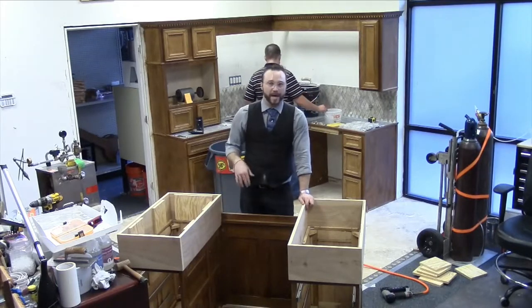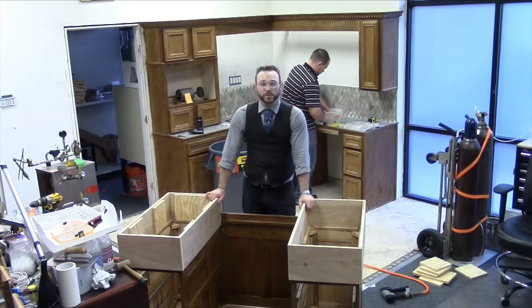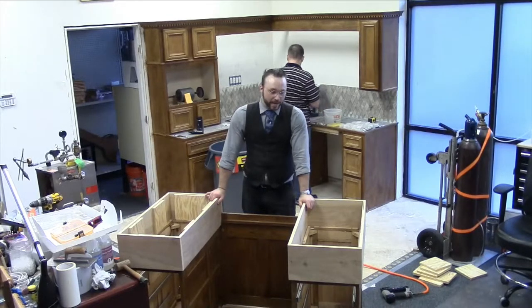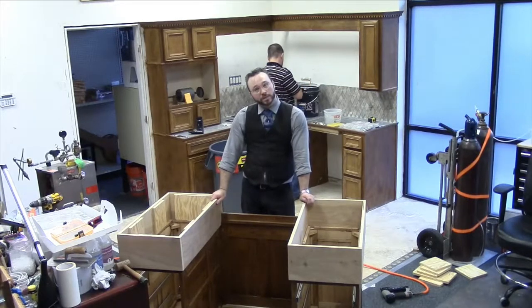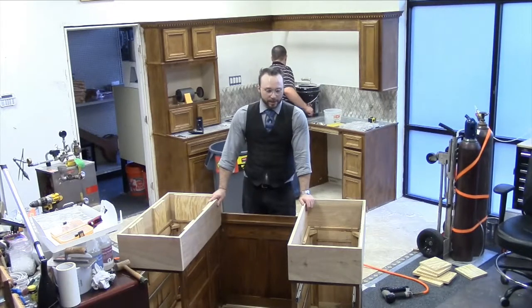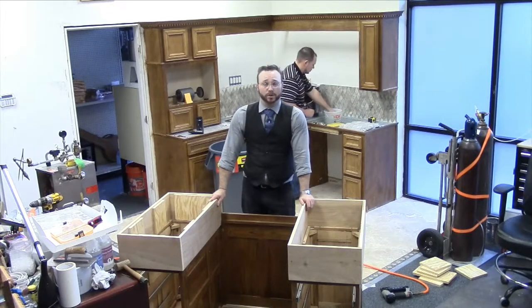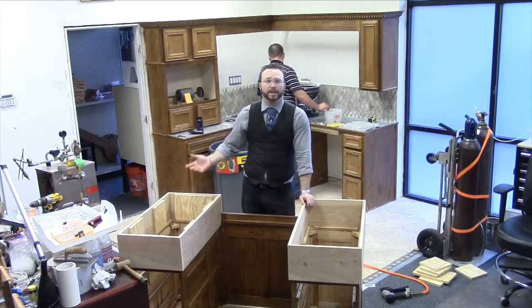These are the two new pedestals. For the more eagle-eyed amongst you, you'll notice I've been whacking on these with a rawhide mallet. The reason is that these are hand-cut to fit as replacements for what was originally here — you watched me destroy those with a different hammer. I cut them in such a way that they are essentially friction fit, meaning the fit is so close that even without fasteners this thing would probably hold itself together. I did that on the premise that the less it was able to wiggle while we're working on it, the lower the likelihood we'd do something to break it.